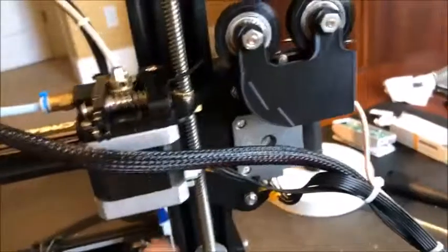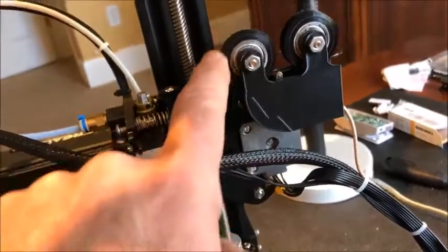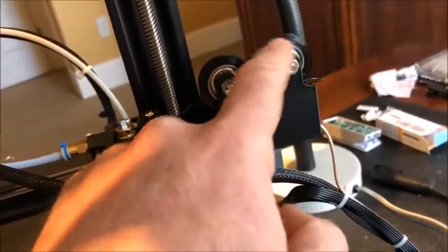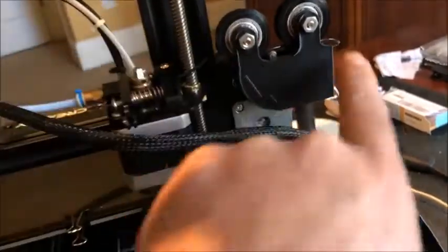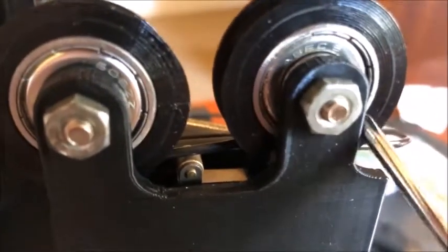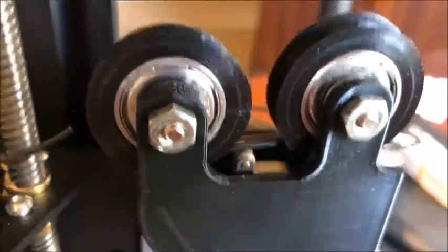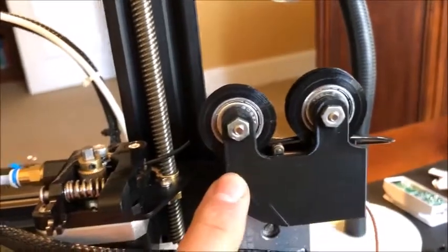I also designed this guide, which uses two ball bearing guides, basically to feed the filament through and keep it nice and straight. There is a switch used as the filament sensor — it has a little roller bearing on it and it works very well. You can see the roller bearing moving when the filament rides across it. It's a pretty decent size switch at about 10 millimeters.